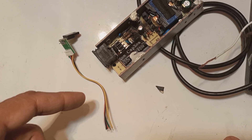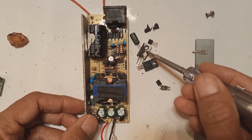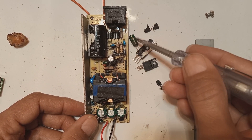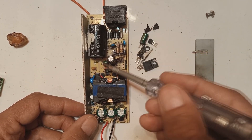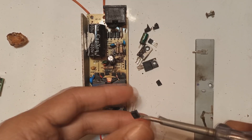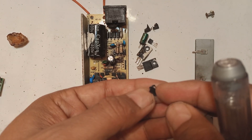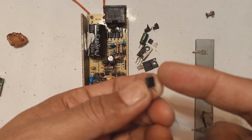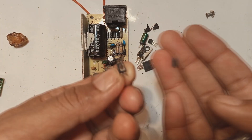After cleaning the board, here you can see the blown components removed from the circuit board. This is the MOSFET, here are the IC chunks, and here is the capacitor — the bootstrap capacitor — which was also short circuited and was replaced with a good one. The IC and MOSFET were removed. The optocoupler has also been broken — a chunk was removed from it and it was short circuited inside, coming out of the power supply in two pieces. So we replaced it.